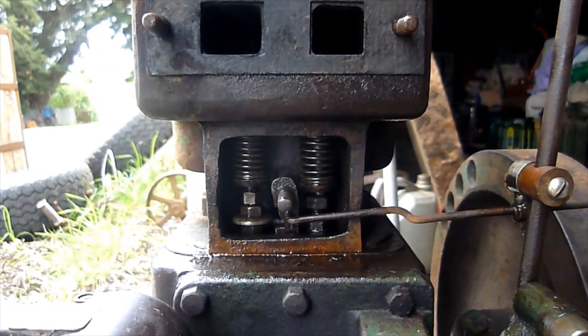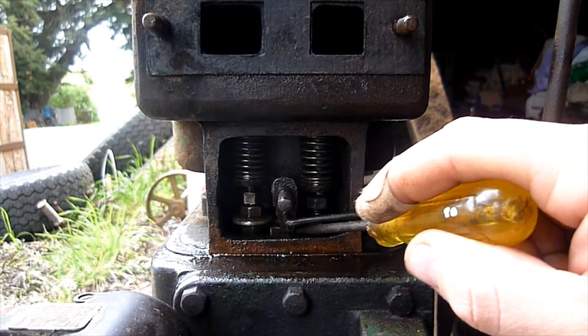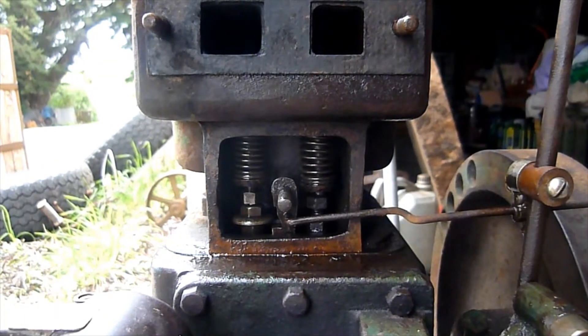This has proved to be a sort of a challenge to get exactly right, as you can hear when we've had it running in video. It doesn't always govern at a set speed — sometimes it will race a little bit. Partly this is down to the type of governor in the N-Type Ronaldson-Tippett and the wear in the governor in the wreck that we used, but it is also down to the design of this latch-out finger, which still requires some modification to get working 100%. It's all been a very trial and error sort of experience. This is why we've left all the linkages fully adjustable so that we can try and tune it in to run just right.